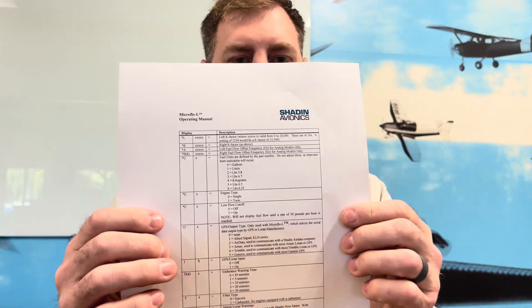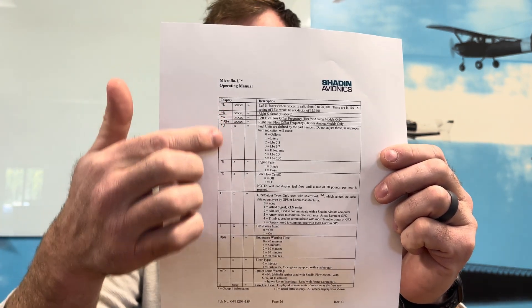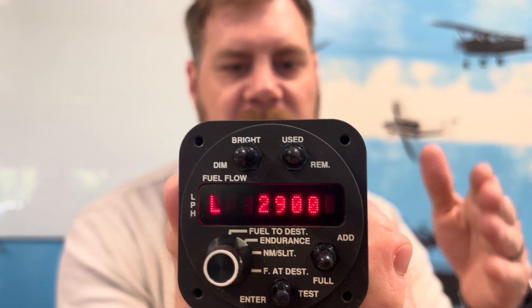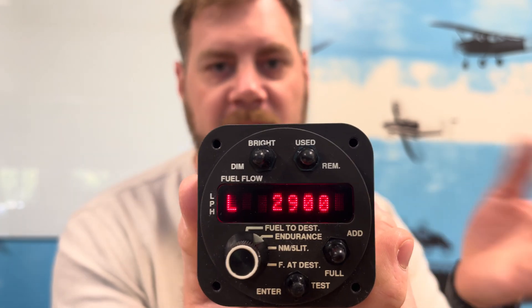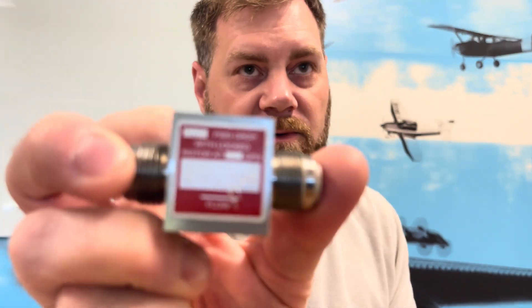On page 26 of the manual you'll see a page that looks like this. It gives you details about what each one of the letters means as you go through the programming instruction menu. You can see right off the start we have a K-factor of 29.00 programmed in. It drops off the least significant digit, so 29.00 means 29,000 pulses per gallon or 29.0. Because our transducer K-factor was 19.94, we're going to adjust this 29.0 down to 19.94.